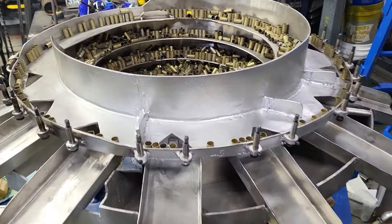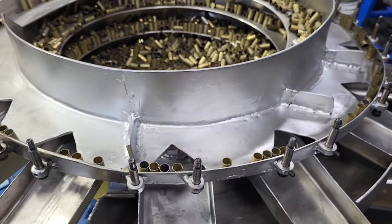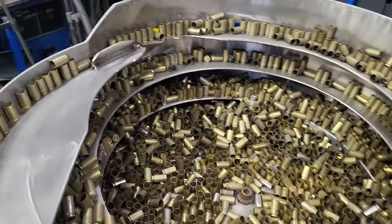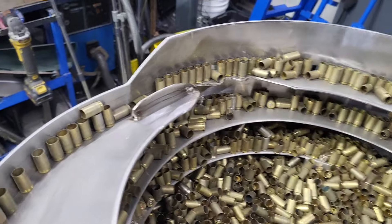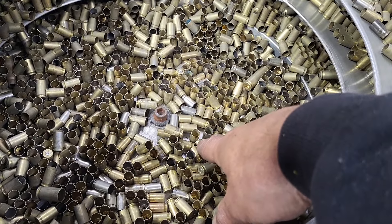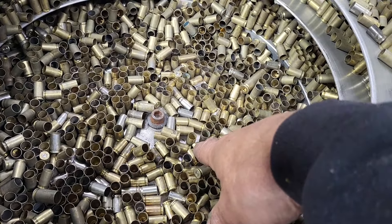On this particular bowl I'm going to show you a few things. I've got the kickers removed — the reason is I want to see how the brass is going. You can see we've got a case on top of the cases, and that is caused by too much brass in the hopper. I'm going to turn it on — it'll get a little noisy.